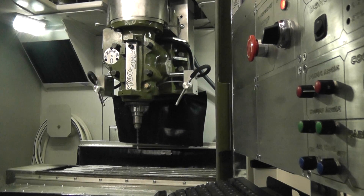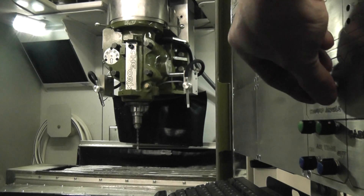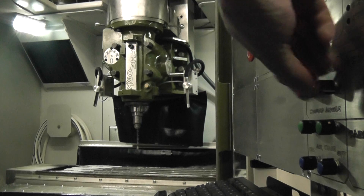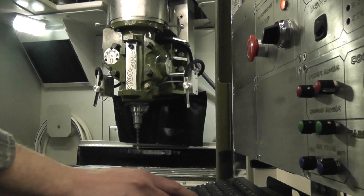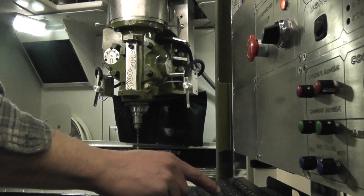It automatically goes back to that function. Another thing I added since my first video: if the nozzles are all the way out to the sides — say if I don't want to use coolant for something — and I have them out to the sides and do a tool change, having them all the way out to the extreme ends will automatically disable the tool change sweep function.